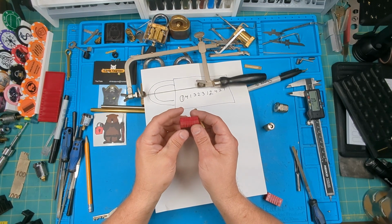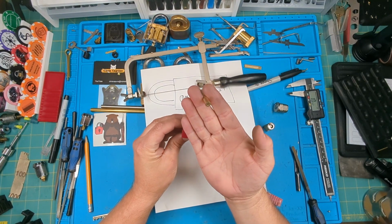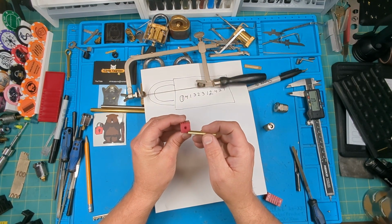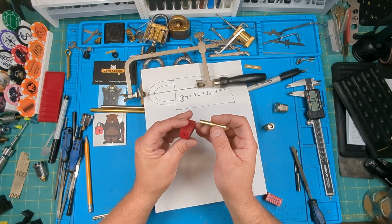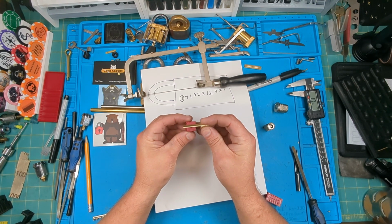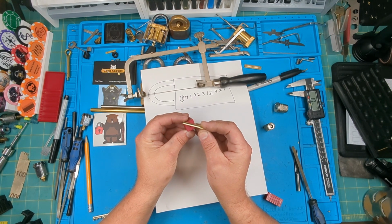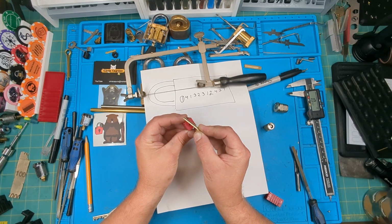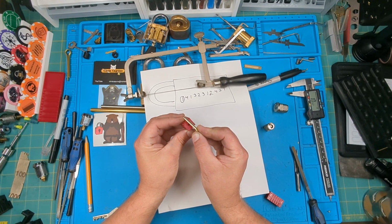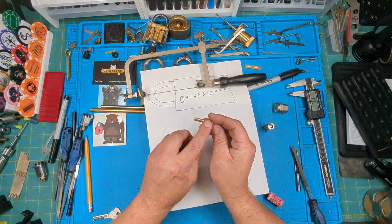Okay. And the way this thing is laid out, it has marks that tell me where I need to cut at what angle, based off of these marks, for whatever cut. So starting with, let's see, a zero cut, or excuse me, a one cut is here. Then you have a two cut, and then it should start hitting the little marks: three cut, four cut, five cut, and then all the way up and down is a six cut. Okay. So this is just to guide me with the jeweler's saw to make my initial cuts.